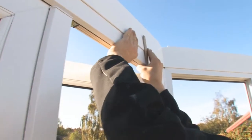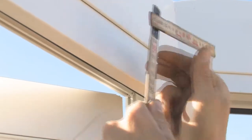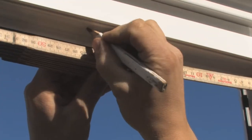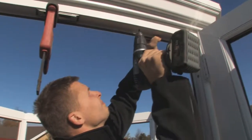Start at the door. Check that the gutters are placed in the middle of the element, sideways, and that the small inside edge of the gutters abuts the element. Drill up into the gutter using a 4mm drill bit. Secure it with 70mm screws. Insert 3 screws in each gutter. Insert the 2 outermost screws at least 25mm from the outer edge of the element.